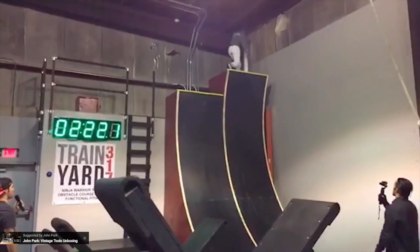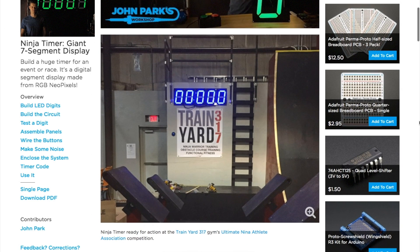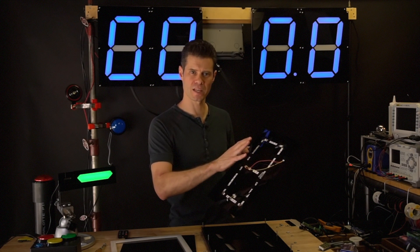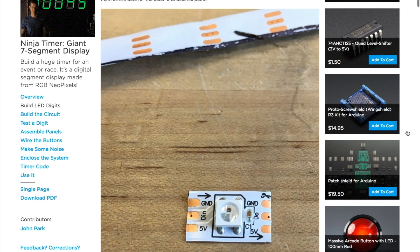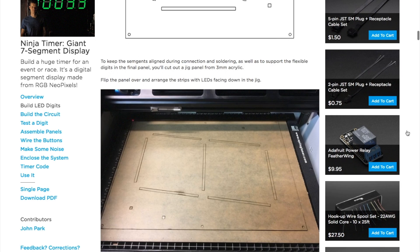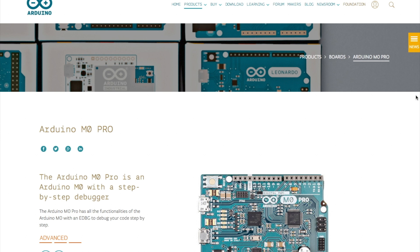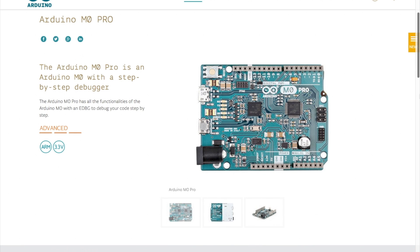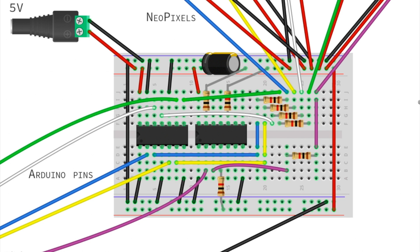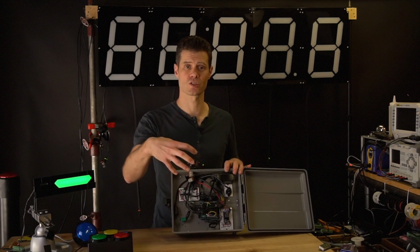For authenticity, John even hooked up a car horn to the finish line button. The real star for me is the documentation John has on building one for yourself. John breaks down what it takes to build just one of the seven-segment digits. Each one is made up of seven sections of NeoPixel LED strip, plus single LED dots for the decimal and colon. John includes CAD files for the sandwich of materials needed to hold and diffuse the LEDs. He cut his out on acrylic using a laser cutter, but you could also print these as templates and cut them manually with a jigsaw or box-cut them into cardboard. The whole thing runs on an Arduino M0 Pro, which has extra memory useful for the code and addressing all those LEDs. John also wires up his own board for level shifting the 3-volt output of the Arduino to the 5 volts needed for the LEDs.